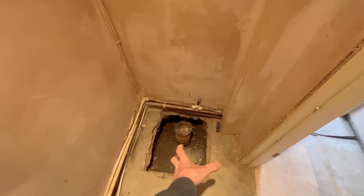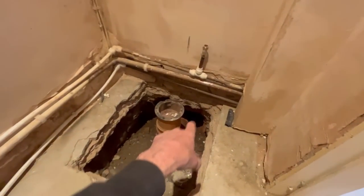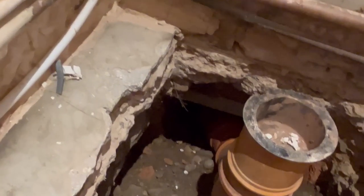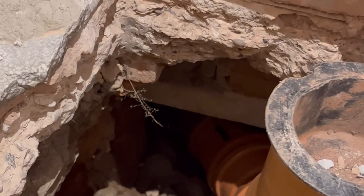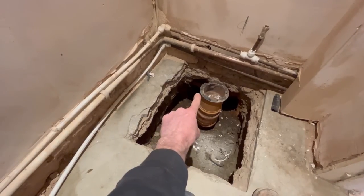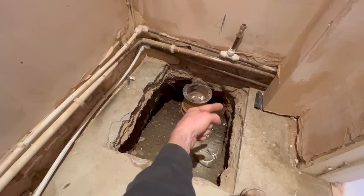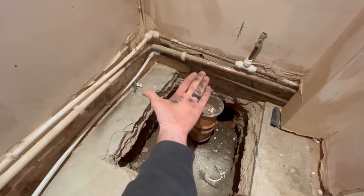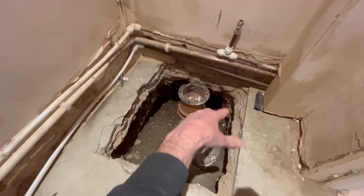And then we're going to decide about putting structure in. But at the minute, we think the best option is to pea gravel and backfill up to the lintel, which you can see there, the bit of grey right in the centre of screen now. That's the lintel. So we're going to fill up to that point, and then what we'll do is we'll come past that lintel so nothing can flow under the floor. Then I'm going to get some insulation, just put it in the cavities either side to stop any flow of concrete. And then we're going to fill off concrete up underneath all of this, right underneath it, so it touches the brickwork. So we haven't got to try and put lintels in there. We reckon that's the best option.